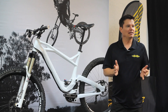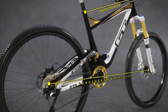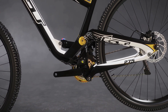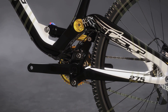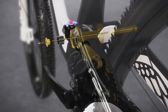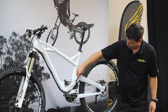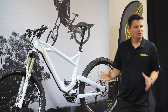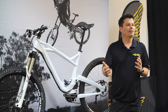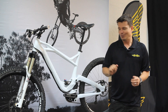We tried to make the best handling bike possible. We made a very long top tube combined with a short stem, so it's a very active riding position. We added the lowest possible center of gravity so you can flip the bike around easily. We designed the stiffest rear end possible by having a through axle at the main pivot, at the second main pivot, at the pivot from the path link to the chain stay, and double bearings at the dropout pivot. Our seat stays, which connect the main frame directly with the dropout, are massive — a very sturdy, very stiff connection. That gives you very precise feel and very good feedback from the tires, so you know exactly when you're at the limit or over it. It's very easy to push that bike to the limit.